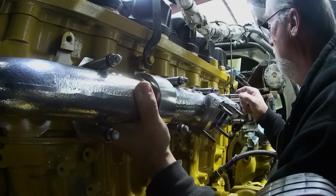I have my trusty O-ring kit to put an O-ring in that turbo fitting down here. Show you right here. This is called an O-ring boss. It's a flat surface on the line. It goes on that. So, okay, one thing we got to do though before I put it on permanent is it'll have to come off again, and I'm gonna put some oil in the turbo before I start it. The oil line goes here, so I need to get a couple of short bolts to go in there. Okay, I want to point out something to you. You see this?